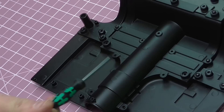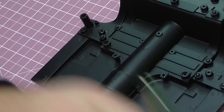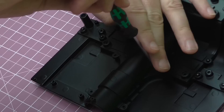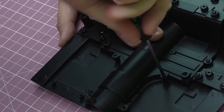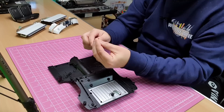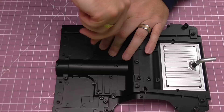Now this is secured from here and from these points here — as you can see, it's rigid, not going anywhere. Then we're going to be putting some more screws in just here and here. A technique when putting these screws in is to put them in a little bit of the way until they start cutting, then bring them back out to make sure there are no shavings on the metal, and then screw them back down again. If you are having problems getting screws in, definitely use the oil technique and use that technique of just screwing down a little way, backing off, then putting them all the way in.